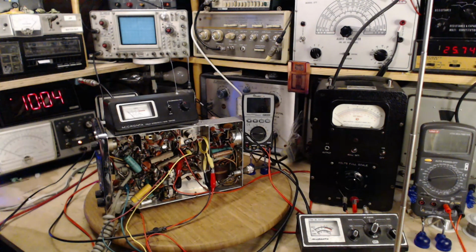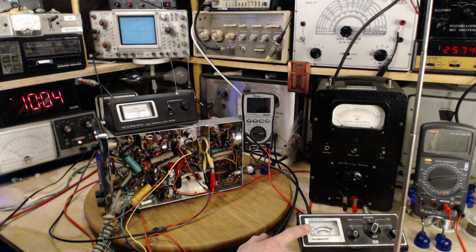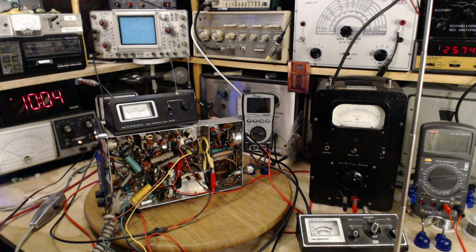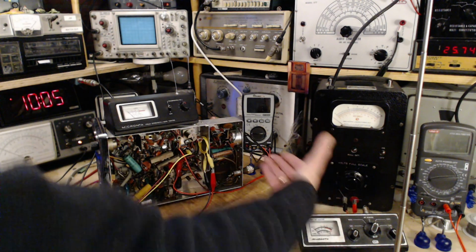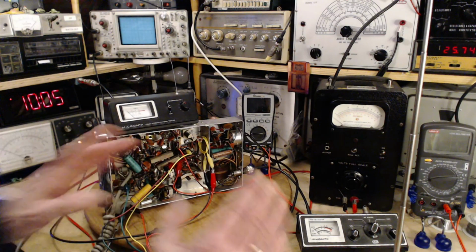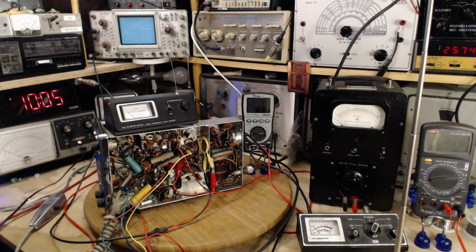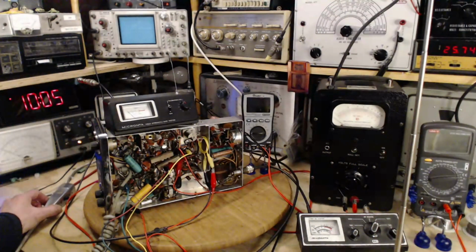Similar to the other SWR meter, the field strength meter we've been using up here, when you use this as SWR, you get pretty much the same reading. Very low. No concern with excess power ending up being consumed in the output of the radio. And again, this is a tube radio. I'm not so sure it's the same concern as a more modern transistorized receiver.